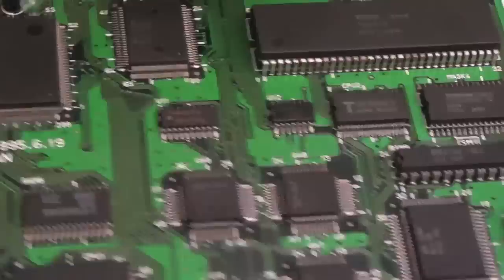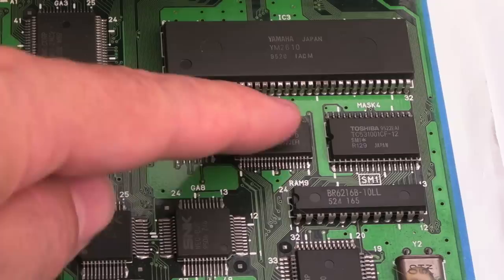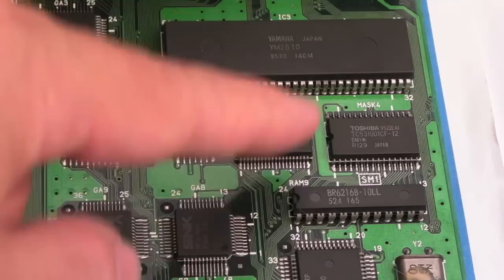And we have got a fault there. The other side of that chip is okay. So there is definitely something gone on there. So whilst I think there's a good chance it could be this, the Z80 is much easier to swap out. I'm tempted to just give this a go first. I've got a faulty Game Gear, actually, that's got one of the main ASICs, I think, has died on it, but the Z80 is probably good. So I might just remove the Z80 here, swap it over from the Game Gear, see what difference that makes.